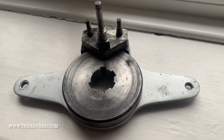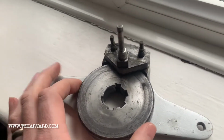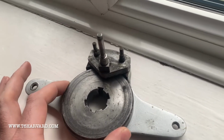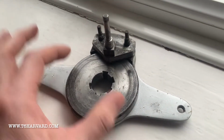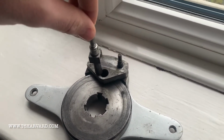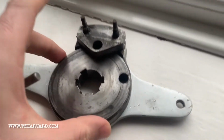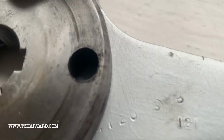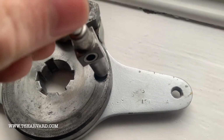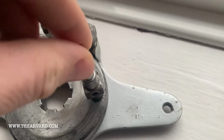So this is our old tail wheel locking mechanism. They've given it to us for training purposes. And you see there's a bit of play in there where the pin has worn the hole. This is our pin. Move the stick forward, the pin's lifted out, allowing the whole tail wheel assembly to twist. There's our hole. That hole's been slightly elongated by side loading the aircraft with the pin dropping in. You see that's now a bit loose in there, causing that play.